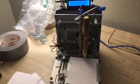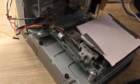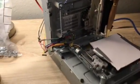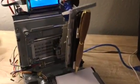This 2D plotter was made by using stepper drivers to help move stepper motors that were taken out of two CD disk drives. This default screen says '2D drawing machine.' You can tell that it uses a servo motor to move the pen up and down.